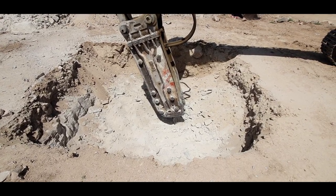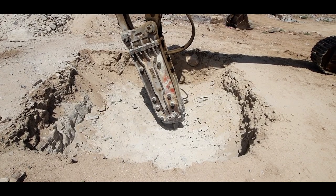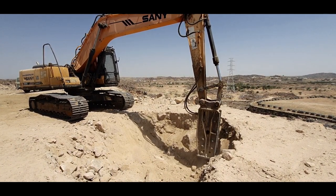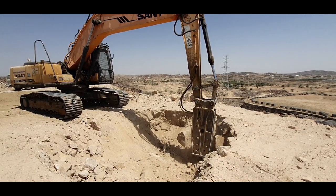Depending upon our necessity, we can use excavator or JCB to excavate the pits. If hard rock is encountered, rock breaker is used or blasting is done. Once all the four pits are excavated, PCC is done to facilitate working platform.